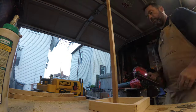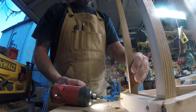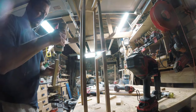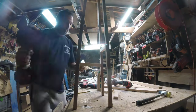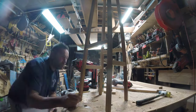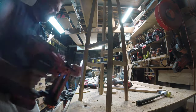Now we're going to flip it over right side of the top facing down and mount the legs into the tops, and also put some wood there to hold them as braces with brad nails and countersink trim head screws. We flip back over — it's coming out pretty nice. We're going to put the bottom braces on. Everything seems very level and straight, which is good. We're using glue, brad nails, and trim head screws for the bottom braces. These braces are just holding the legs at the 10 degree angle for support — they're not bearing any weight since there's no shelf on the bottom.